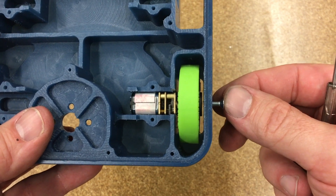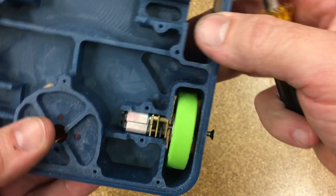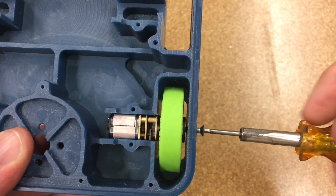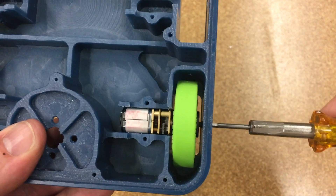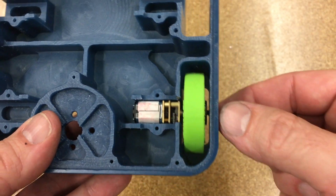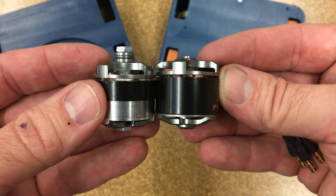The way I'm hoping to fix this is by supporting the wheel from the outside. On the new chassis I've added holes that are centered on the wheel axis. A screw goes in and lines up with the wheel hub, giving it support on both sides. The screw sits flush so it shouldn't get hit, and that's how I'm hoping to fix the play issue.